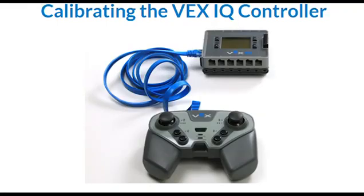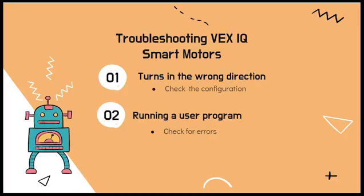If the smart motor turns when the controller is not being pressed, please reference the sheet on the following steps to troubleshoot the solution. If the smart motor turns in the wrong direction, check to see if the configuration of the smart motor should or should not be reversed. If running a user program, check the program for possible errors that might cause the smart motor to move incorrectly.